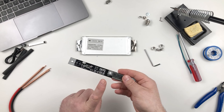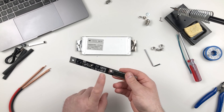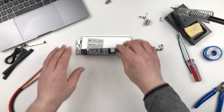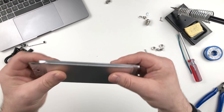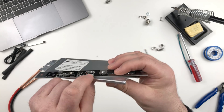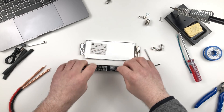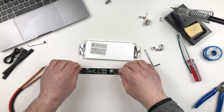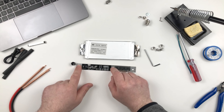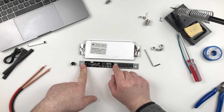I decided I'm going to solder the negative electrode to the board. Using a screw risks puncturing the battery because the bolt and the battery sit flush — so having a screw underneath poking the battery is a big no-no. So let's solder the buzzer, the negative electrode, and the positive electrode. We can use the screw together with the battery to hold it in place.